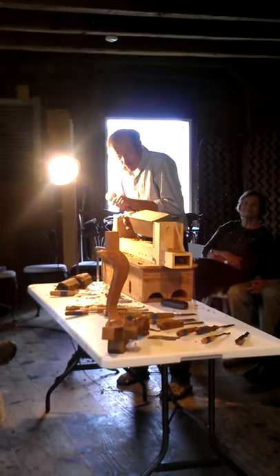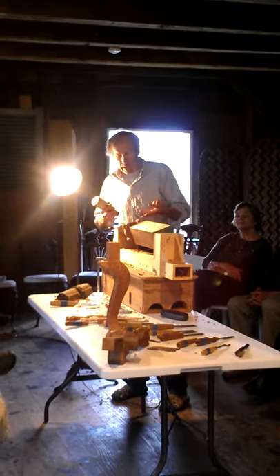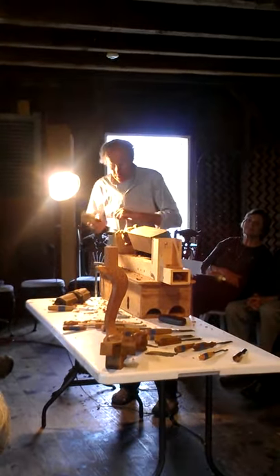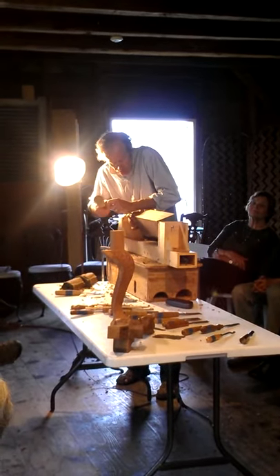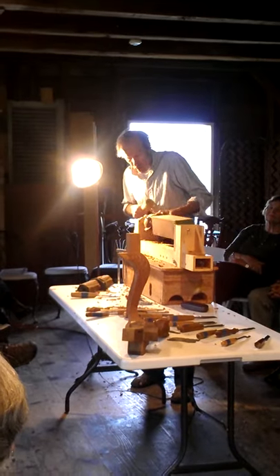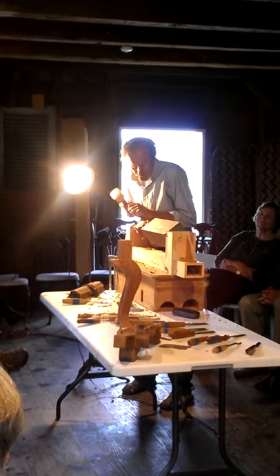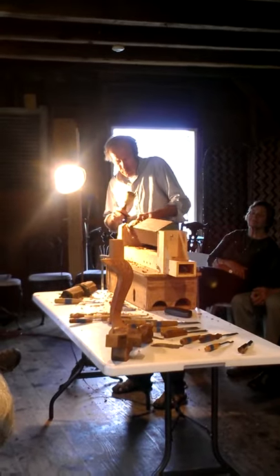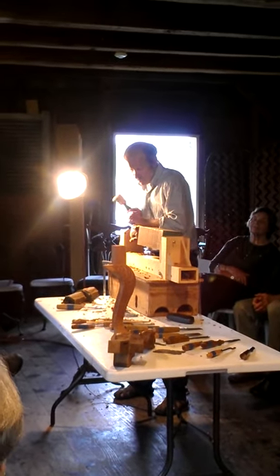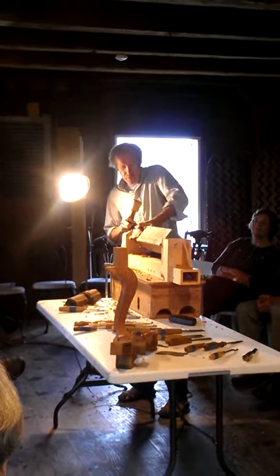Where the ball and the claw hit each other — just following this up. There is no straight line in this thing anywhere. No straight lines. And so you'll never see me use a straight chisel. I didn't bring a straight chisel. There are people that teach how to carve a ball and claw with a straight tool, and they spend a lot of time with it, but I can have mine done by the time theirs is roughed up.